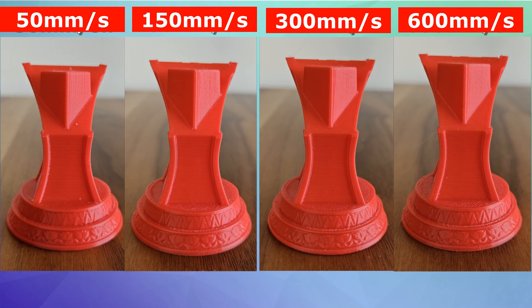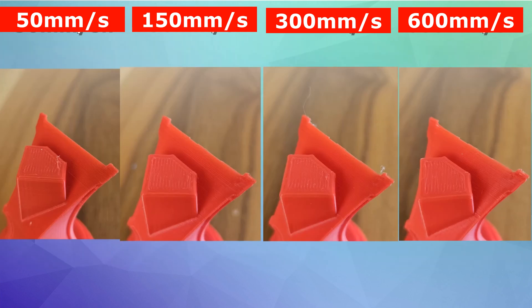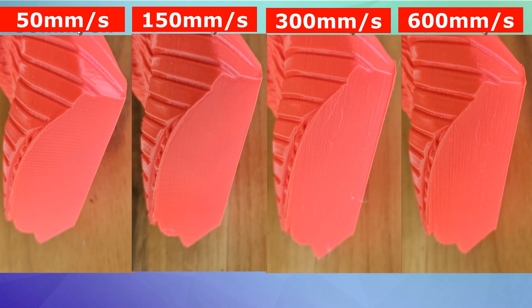This model consisted of two parts — the base and the body. On the base, there are minimal differences. As speed increased, internal fillings became more noticeable on the outer surface, though it's very unclear and might not even be visible in photos. There is also an increase in vibration effects, but it's quite minimal. The most obvious difference is at the top, thin part: at 50 mm/s it's quite sharp and clear, with slight roughnesses at other speeds. When looking at the top part of the model, differences are quite minimal. Looking at the symbols and patterns on the chest part, you can almost not see the difference. On flat surfaces like the base, the traces of internal fillings are visible on the surface at speeds of 300 and 600 mm/s — this can be fixed with settings.